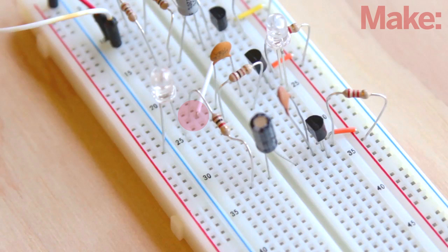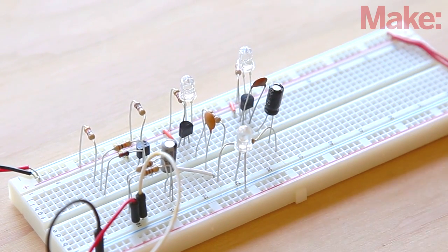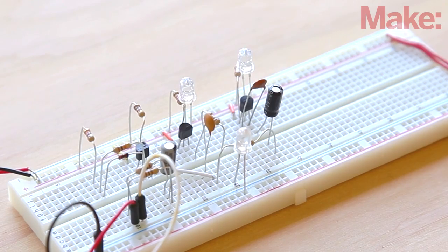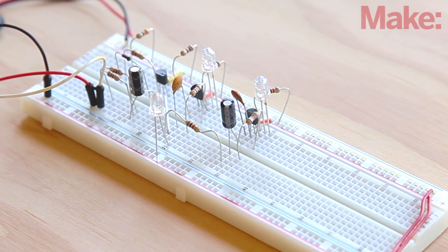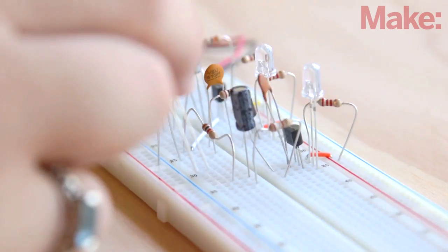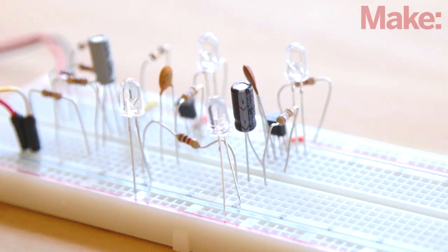The three filters will all connect at this point. Connect a green LED's positive leg to the rightmost leg — the collector — of the transistor. Connect the 180-ohm resistor from the negative leg of the LED across the trough. Insert the second green LED into the breadboard with its positive leg to the 180-ohm resistor and its negative leg to ground.